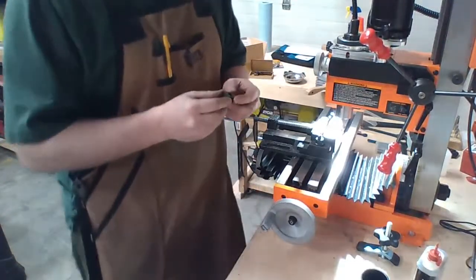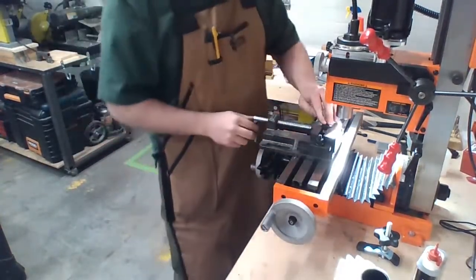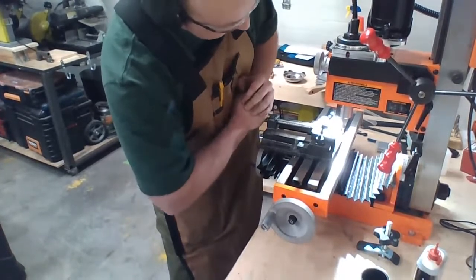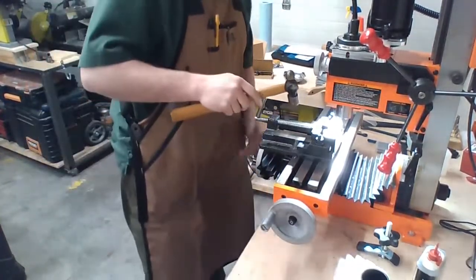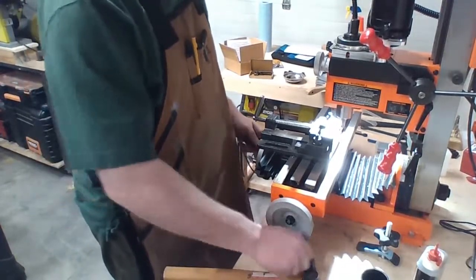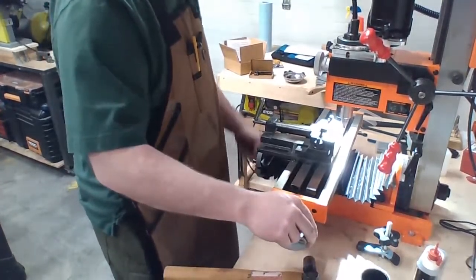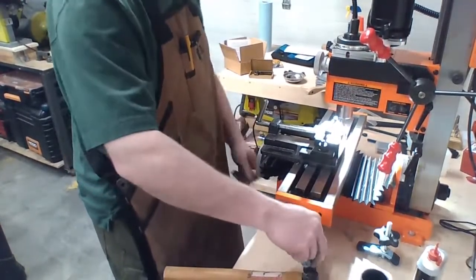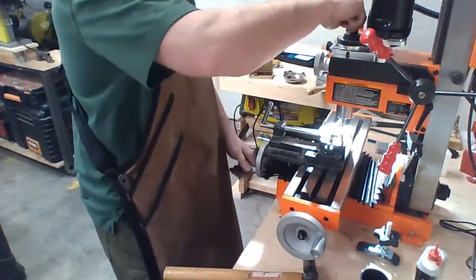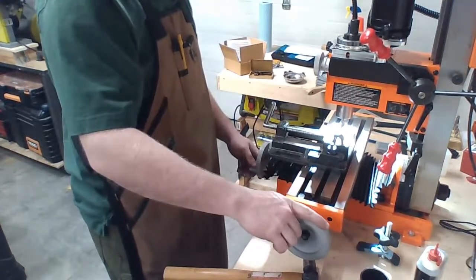So I'm gonna have to also do this. I have to mill the last thread so the rods don't go all the way through, because you don't want the rods going all the way through. If the rods go all the way through, you can get some weird binding action. You want to stop in the actual threads, not binding the bottom of the T-slot. So I want the groove to be what's preventing any more travel.